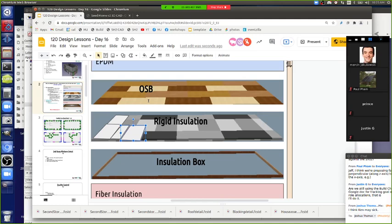Yeah, maybe this is not good here. Maybe we have to do, because if you look at the OSB on the top row, you also want to try to minimize seam overlap there too for cold bridges. So you'd probably want to overlap like this here over the middle, more like... Well, somewhere your seams are going to overlap, so you kind of have to scratch your head a little bit. What's the best way to overlap so that we're all good?